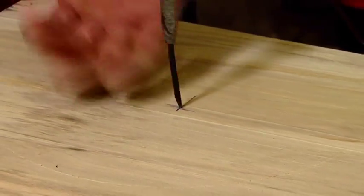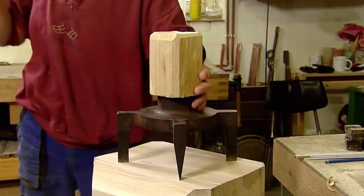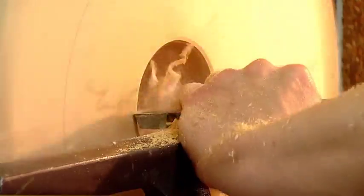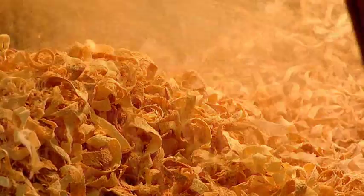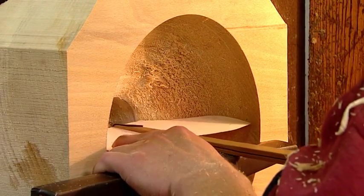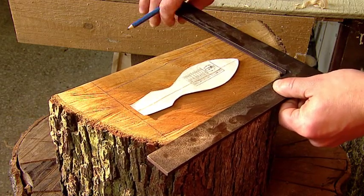The basic material for mold production is hard beech wood. The wood must be free of knots and with a small core. Only then is it suitable for molds designed for large products. Pear wood has a similar structure to beech wood. It's used for mold manufacture for smaller products such as glass stoppers or small glasses.